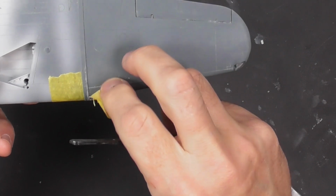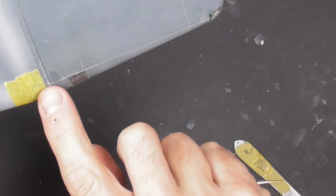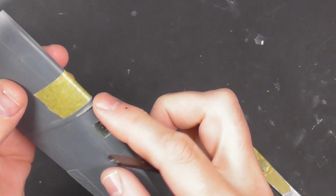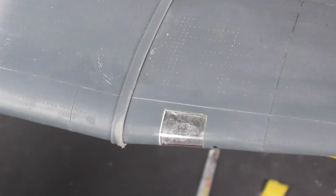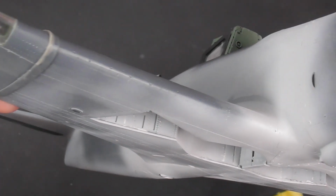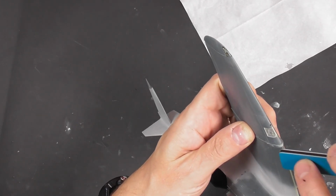That's part one of the operation. Next part of the operation is using plenty of water and the back of a knife blade. We can just go and tidy everything up. And there was no real sanding along the sort of the contour change. Little bit of sanding around the radius just to match up the height of the repair to the strengthening strip, but nothing required on the sort of join of the outer wing panel.